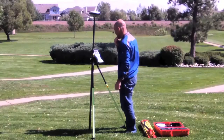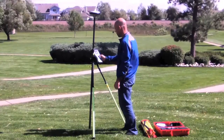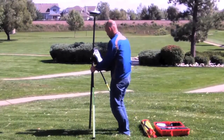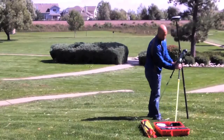So now what do we do when we lose our GPS network? We'll take a measurement on the network and we're going to set up our other GS-14 here over this point as our base. In this case we finished and stored the point, and we'd like to now set a base up over this exact same location using just the other GS-14.